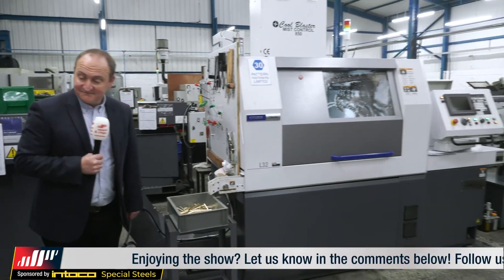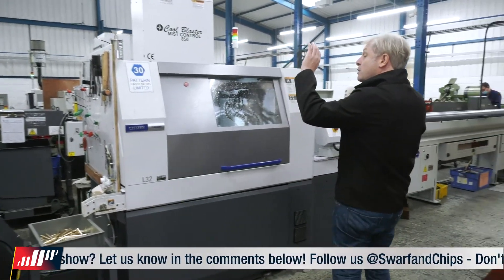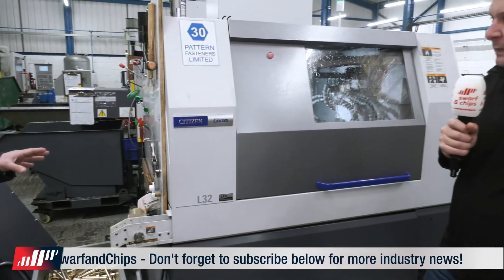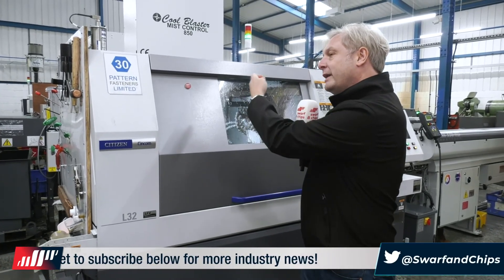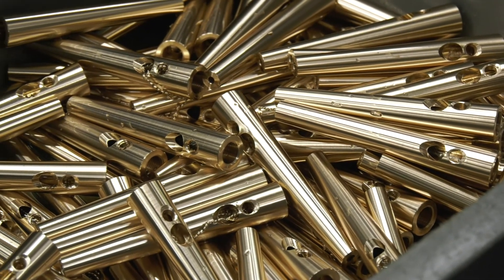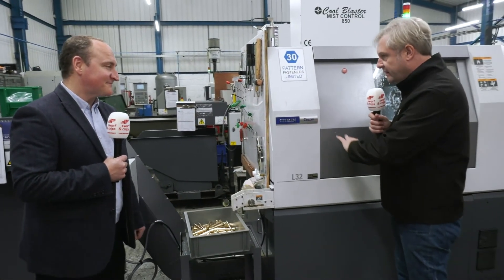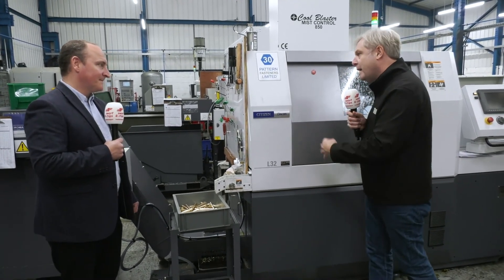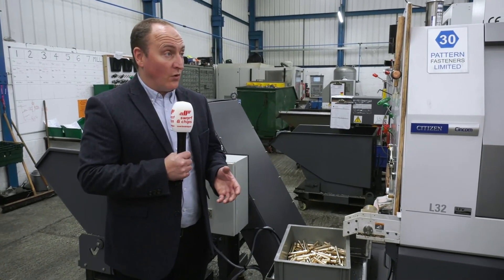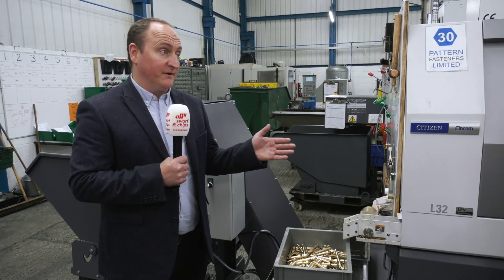What we've got behind us is a great timeline of the next stage of the company's evolution. You've got your Citizen machines — a new L20 from a couple of years ago, and this machine we've had over a year. L32, L20, L20 — bars getting bigger, why is that? We started with a 20, then gone 20, 32, 20, 32, 20 and 32. It's suited us quite well in terms of the variation of work we've got in size. And you've gotten the LFV technology — how has that helped you guys? Certainly with some of the harder materials, and particularly with plastics where you're likely to get big nests of swarf — very, very good for that. You can take a plastic job and it will chip very easily with the LFV.